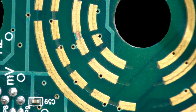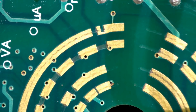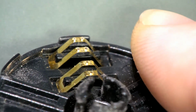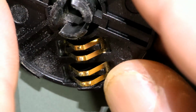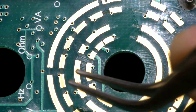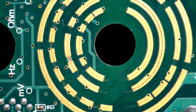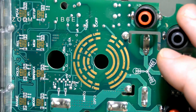But see, the contacts are still fine. They seem to be okay. You'd expect that sort of wear after 50,000 odd cycles. It's very clean now. So it was really only that initial number of cycles that caused the problem. They look to be in pretty good nick. No worries whatsoever, and there's really hardly any metal wear on that. The thing we're of course concerned about is metal scraping off either the pads or the contacts and then getting in between pads and shorting them out. And we really don't see any major evidence of that. So that's very impressive, I think, after 50,000 cycles. 51,000. Nice.